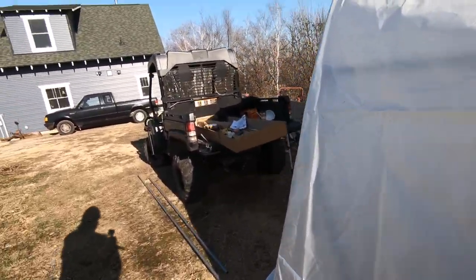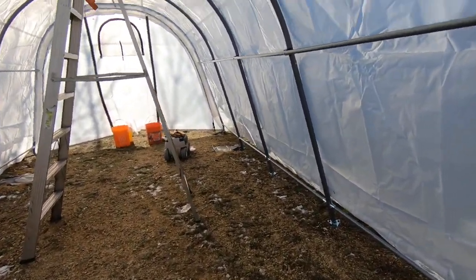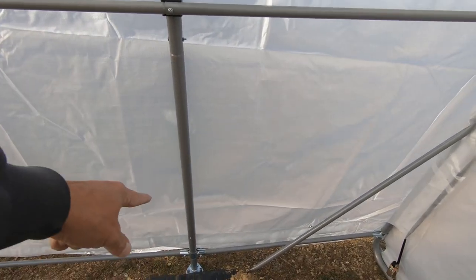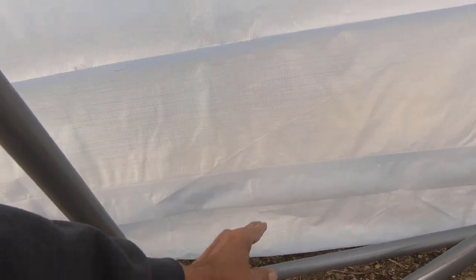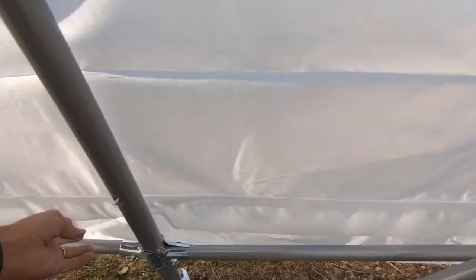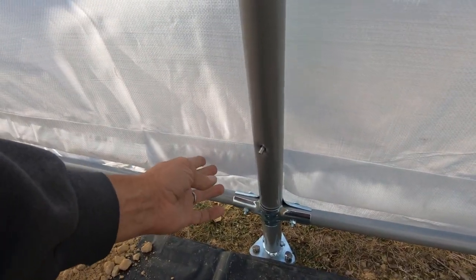This pocket needs to end up 8 inches above the ground. Get inside. It's pretty close. So I gotta jog it until this pocket will accept this pipe, and then push it, pull it, whatever it takes to get it about 8 inches off the ground, then tighten it up. Yeah, it looks like it needs to come forward a little bit as well. You can see this is where the opening should be. It looks like it needs to come a few inches this way.